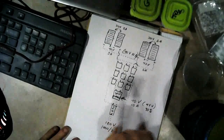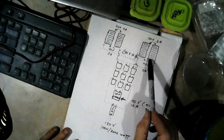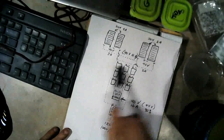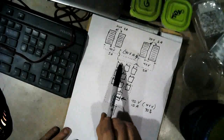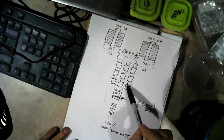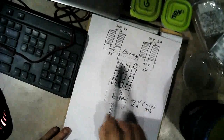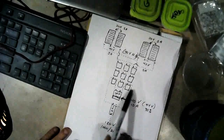There's no voltage regulator or anything — I just designed it so that the current always flows downhill like water. So 40 volts goes to the 36-volt battery system. I've got 12 batteries set up in series going across this way, and set up in parallel going this way. My panels come in on each side to charge the 36-volt system up. Then I take 36 volts off on the other end of the batteries.